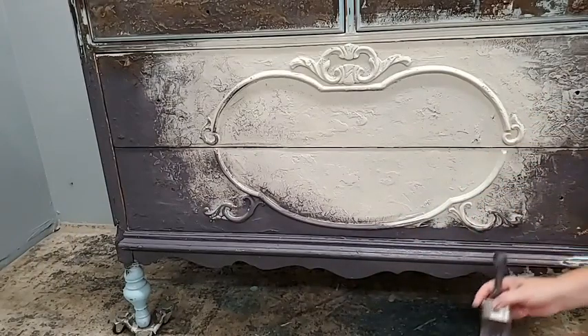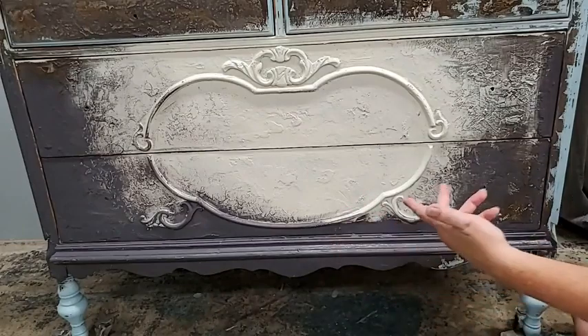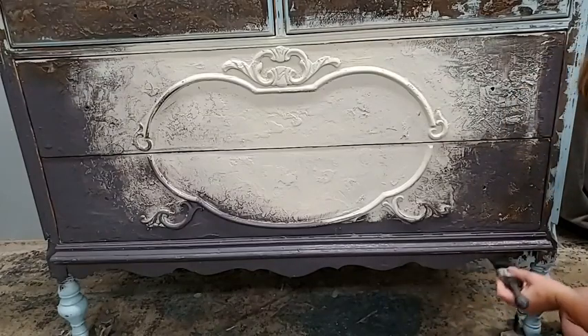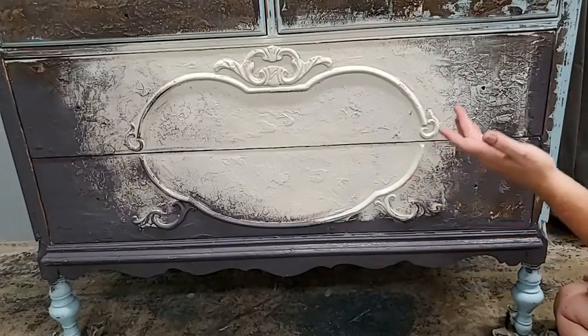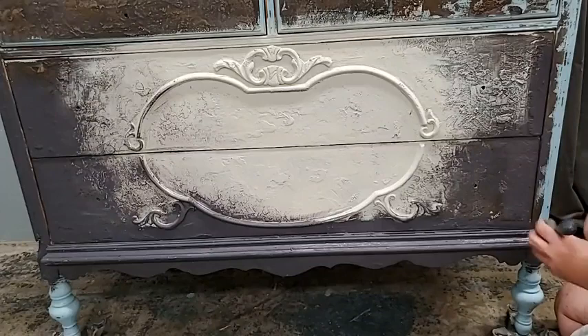Since we're down low, these legs are still blue — I hate this thick, chunky latex paint. I'll take the drawers out and paint around the body too; maybe we'll do one tonight so you can see. Since this is a start-to-finish piece, I am going to sand these legs down to raw wood, but I'll have to flip the piece onto its back to do that. At some point you will see the raw wood legs — I think it'll be pretty to have the raw wood legs and raw wood top tie in together.